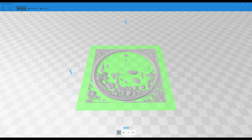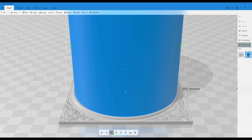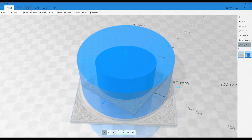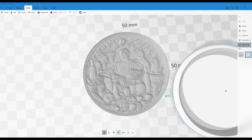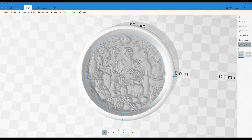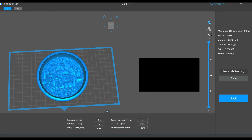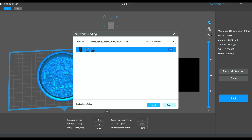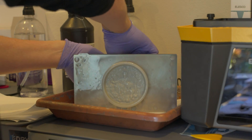We'll add that to 3D Builder where I'm going to make a couple of minor edits — make it flat, punch it out to the right sort of size that we want, and merge it with a template I've already got for a coaster. I'm going to add the wine bottle coaster here, line it all up, make sure it fits nicely in the bottom, and then save that out as a complete STL. We're then just going to print that in our normal software, sending it off to a resin printer. From there we've now got a 3D pattern ready to go for the sand casting.